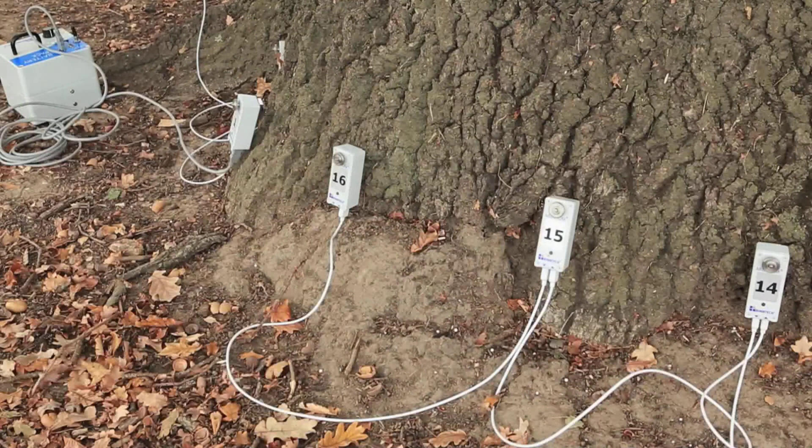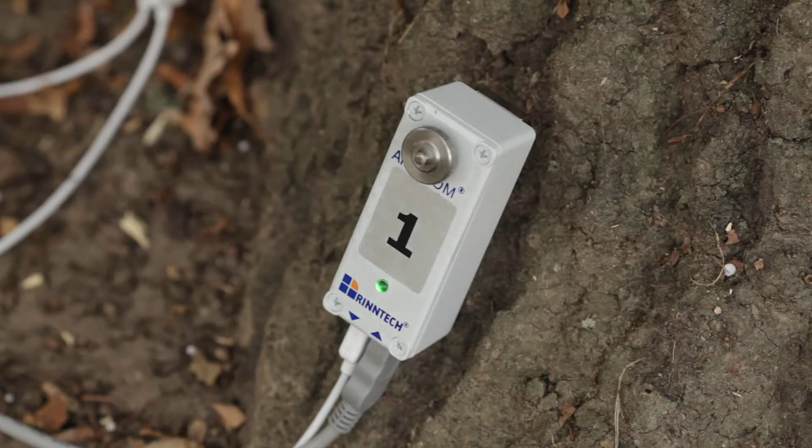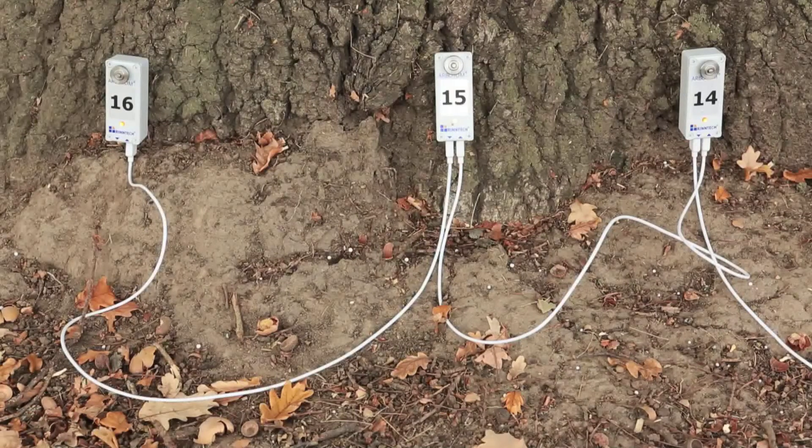All the sensors are on the nails. I'll turn on the battery pack and we should see green lights appear on all sensors, except sensor 16 which will be an orangey-yellow colour. Sensors 1 through most of the chain are green, but sensors 16 and 14 are not — 14 should actually be green, so I've made a mistake and put the cables in the wrong way. It is absolutely critical that if you make any changes to the cables, you always turn the battery pack off first — never leave it on while changing cables, otherwise you will damage the sensors.